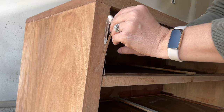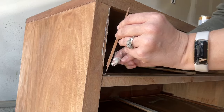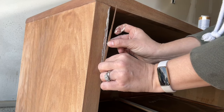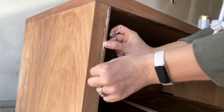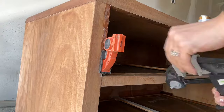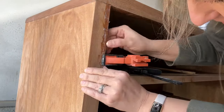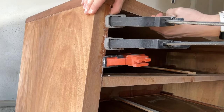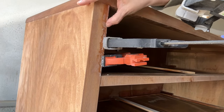From there I had to glue up a loose piece of veneer and I just clamped it while it dried. I should have used a damp cloth to wipe off the excess glue so I wouldn't have to sand as much once I removed the clamps, but again it's pretty foolproof — just clamp it, let it dry, then sand it once fully dry. Usually about 24 hours for wood glue.